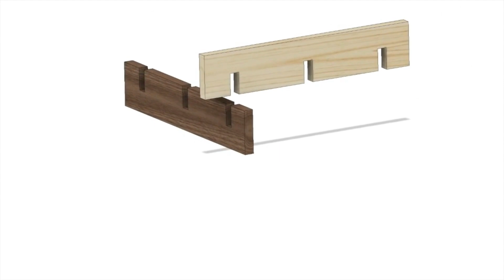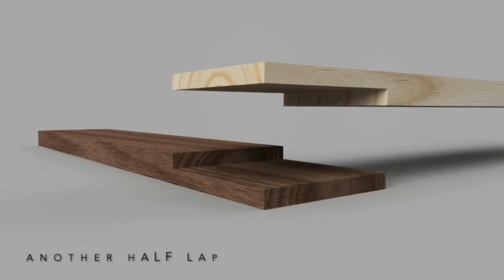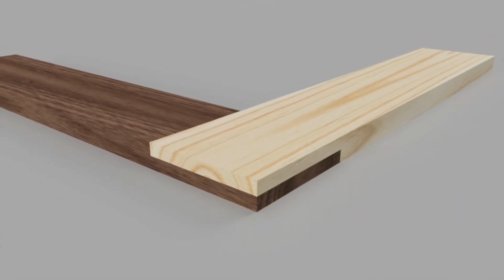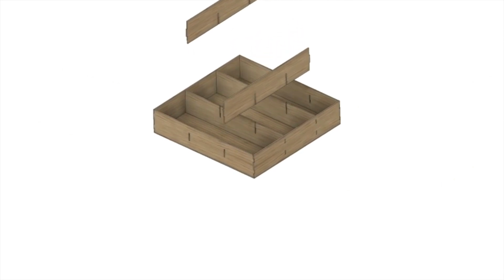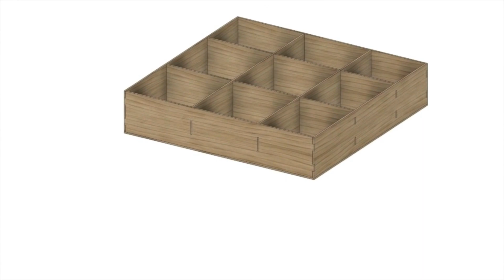The half-lap joint is where half of each of the two boards being joined is removed, so that the two boards being joined come together flush with one another. This type of wood joint can obviously weaken the strength of the two adjoining boards, but also is a stronger joint than butt joints. There are a number of projects where this type of wood joint is quite desirable in spite of its drawbacks.